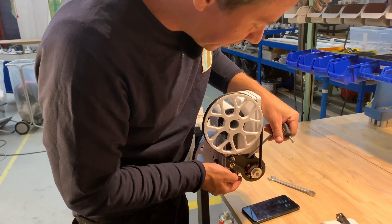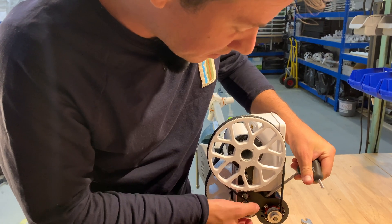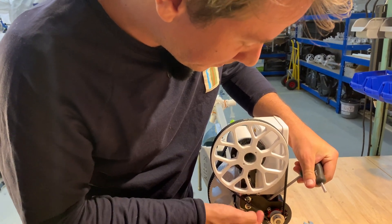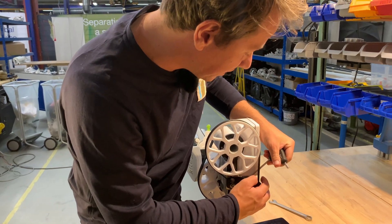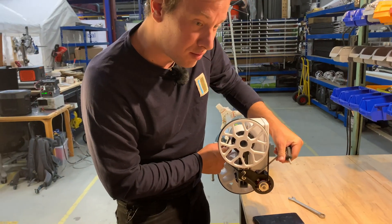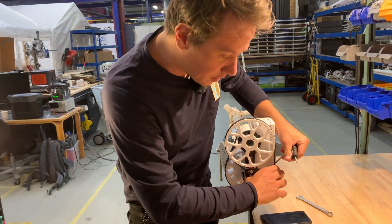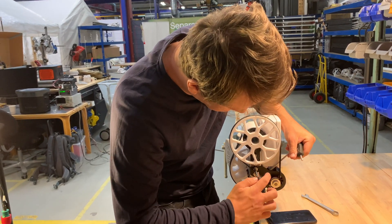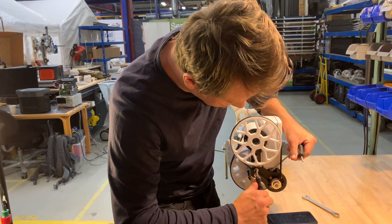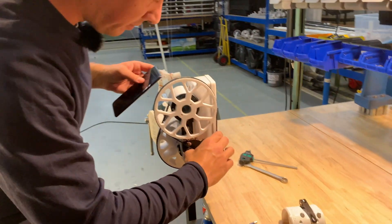You can feel the tension as I press it down — I get increased tension here. What we're looking for in this motor belt is looser tension than in the lower one. So again I go by finger feel — this is pretty tight. Let's tighten it a little bit down and do a measurement.